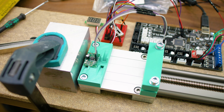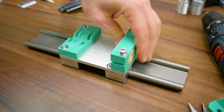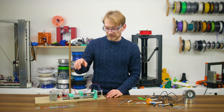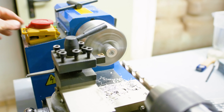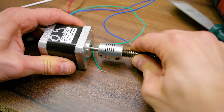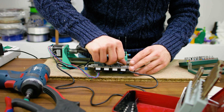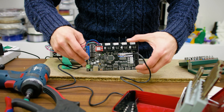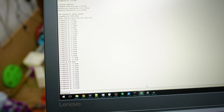To test the repeatability, I built this assembly that should provide near-perfect linear motion for testing the sensors. It's an Igus W rail, which as a sliding mate should have better repeatability than ball bearings, and backlash doesn't matter much since gravity is pre-tensioning things. There's also an Igus 2mm pitch trapezoid spindle attached to a 0.9-degree stepper motor. The two shafts are touching inside the coupling, so no springiness. The entire thing is driven with an MKS Gen board and a few lines of Arduino code — you can still run Arduino code on any 3D printer board that otherwise runs Marlin firmware. All it does is run the sensor into the surface, back up a bit, and repeat 41 more times, then report the standard deviation of all measurements.